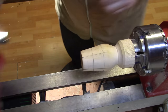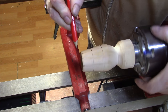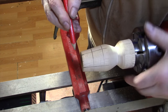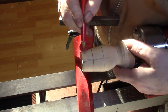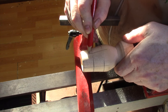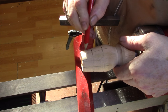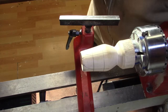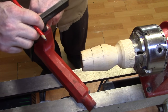Where I'm going to curve the petals, I just do it by eye - I don't measure it. I'm going to go to there and the petals are going to come down in a straight cut to there. So there's our first two marks. Now all we do is get the pencil on each of these marks using the tool rest and come down in a straight line, and this will give us our five petals. In between the lines I drew, I just put a little dot - I just do it by eye, guess the centre. It doesn't have to be perfect. I just draw round from this to there, which forms the petal. It doesn't matter if your curves aren't great - when you come to do the sanding you can finalise your petals.